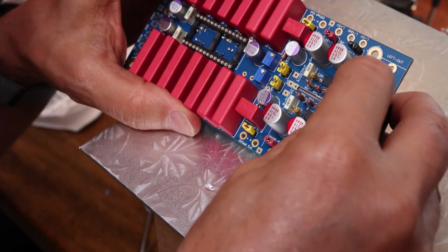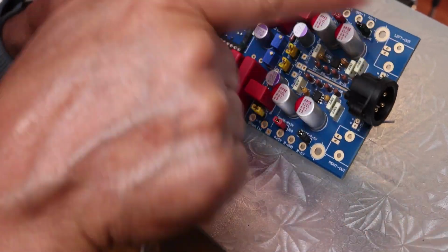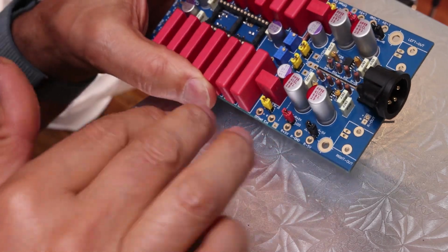There's a couple of things that are surface mount, like the OPA861 chips, but 95% of the DAC is through-hole. But it's through-hole in a tight version, in a 4-layer design, so it keeps all the characteristics of a surface mount, yet it is through-hole. And you can use some very high-quality parts. Actually all the parts used are from Mouser. They're very high-quality parts, and that's another thing. It's one thing to design something and then not use good parts, because parts can make or break any system.